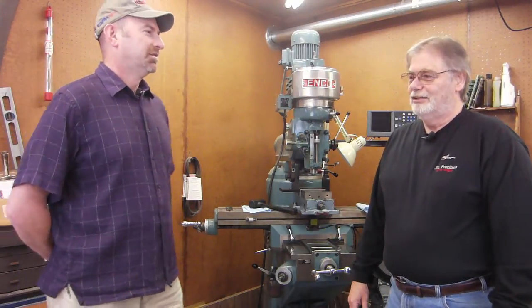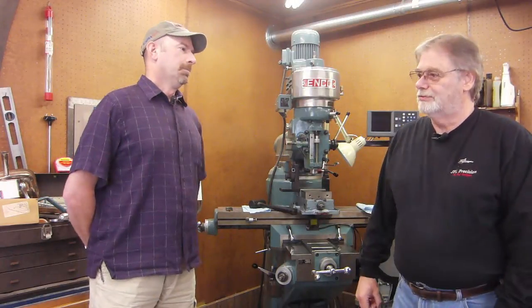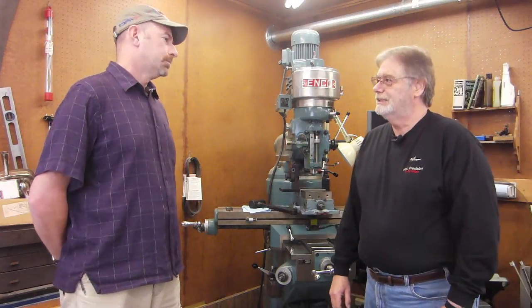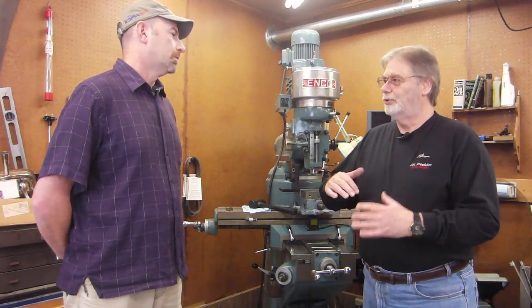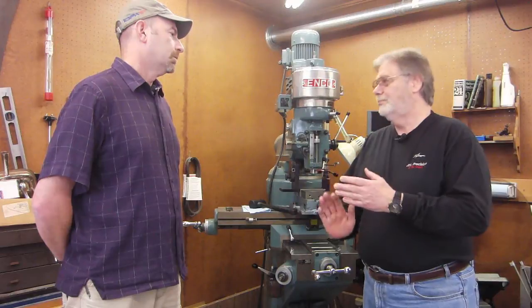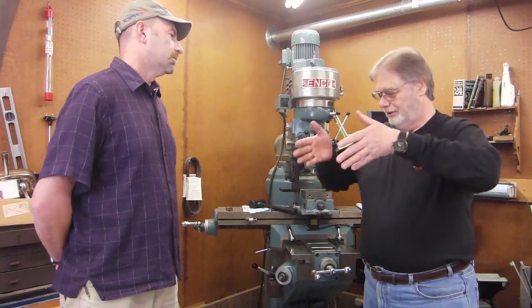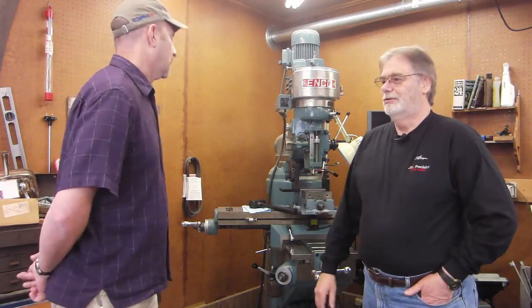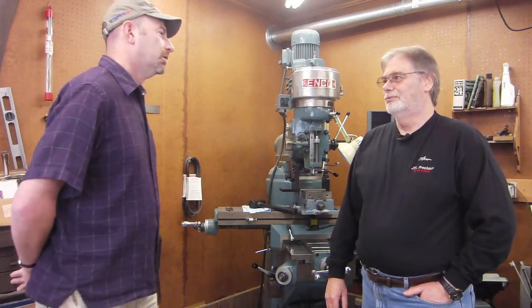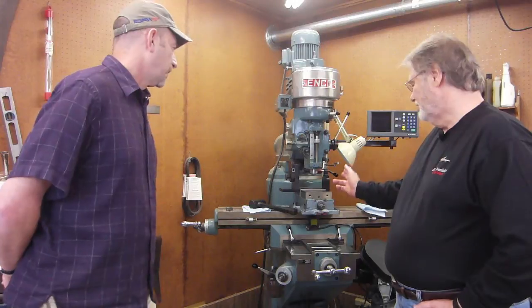Right. Before I got this fixture that I use now, which is from Neil Keller, Custom Ballistics, I used a rotary table and built some tooling to hold a frame by the rails so the grip is straight up, and then got that all dialed in and checkered on that. You can take the table and turn it 90 degrees so you can do longitudinals as well as radials on it. But that's just a real time taker to set up. This thing goes fairly quickly.